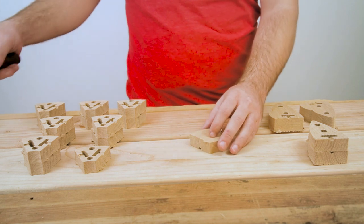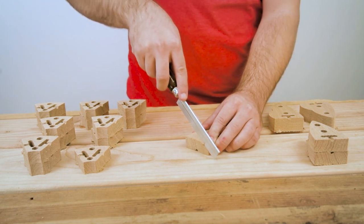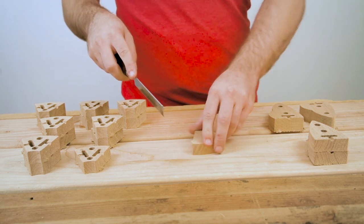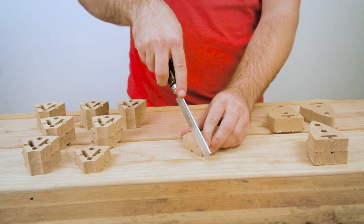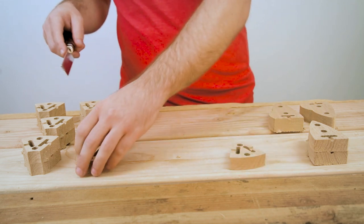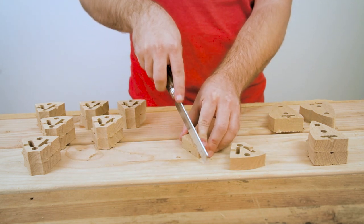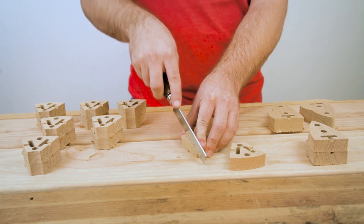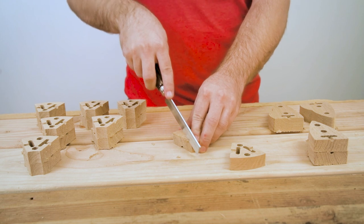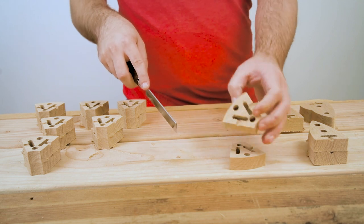For removing the tabs, I did want to keep them nice and small so the process goes quickly, but for future cuts I'll make them a bit thicker. I take them off with a flush cut saw, using the flat faces as a reference edge. It's nice to have tabs on an easy flat surface like this — whether you run it through a router, use a saw, or sand them off, it gives you an easy reference point to get everything lined up and even.